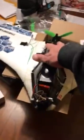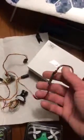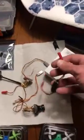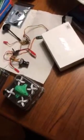Now I'm not dependent upon the battery source, the big 3S and 4S that you need to also, by the way, run one of these filters into your VTXs. You'll get rid of the noise, and you also won't have any danger of frying your VTX or your camera with like a voltage surge or something. It's smart to do. It doesn't say you have to, but if you do some research on this wing and the FPV, you want one of those filters. It really makes a difference. But anyways, back to this.